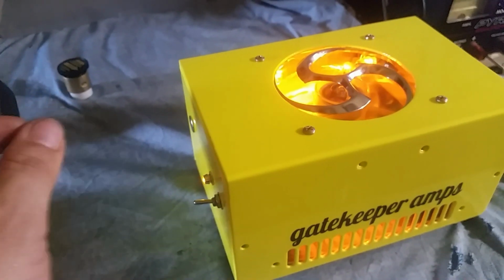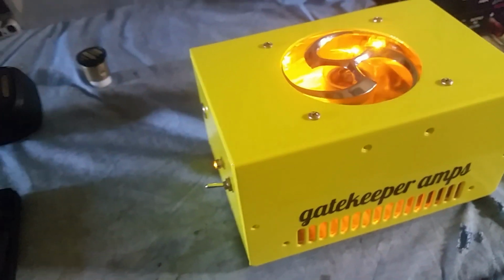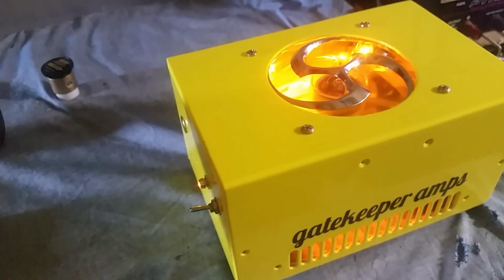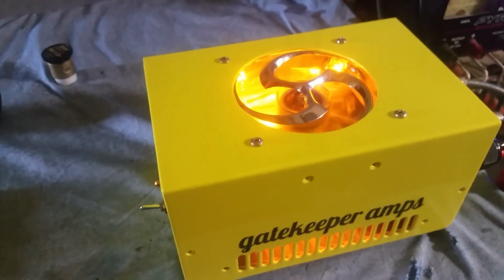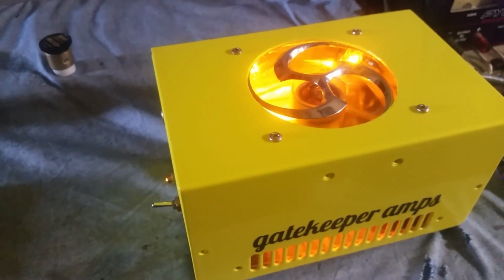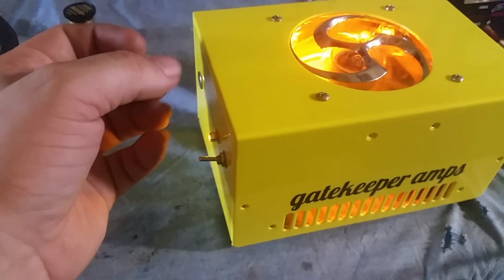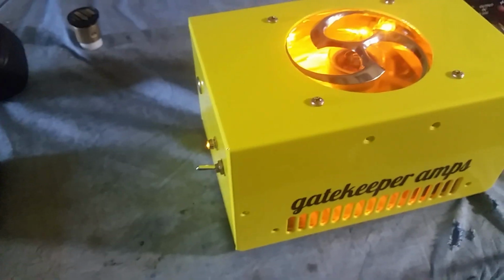Because yeah, a variable does take a little bit of dB out of the power that's going to be going into the actual amplifier. So if you take a variable out, your power is going to come up just a bit. But sometimes a variable is needed, especially if you got a radio where you don't have a whole lot of control over your dead carrier and all that good stuff. So experienced operators don't need variables, unless, like I said, it's specific, like let's say you got a radio that'll only go down to 2 watts or 2.5 watts and it won't go any lower. That variable could help you turn that thing back just a tad bit, to turn that 2 watts down to maybe 1.5 watts or so. So it would be a good thing at that point.